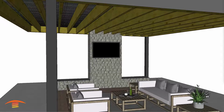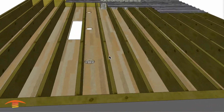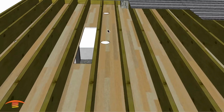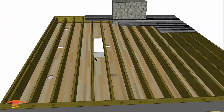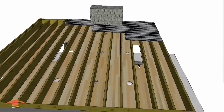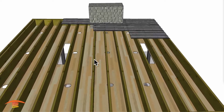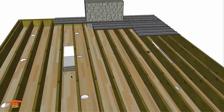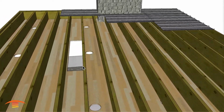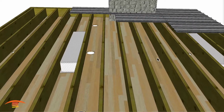And let me go ahead and put that ceiling back on here, and I'm going to take off the rooftop here. And you can see here that I've matched it up to what I believe the rafters might be at. I like to have the heaters at about 8 foot center to center, but because of the lighting, I can't do that unless I move them outside of each other. So I just brought them to where the center closest portion of the joists are, so that they would fit in here. Let's go ahead and look at the heater itself.